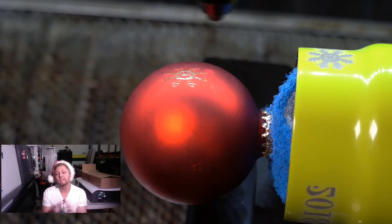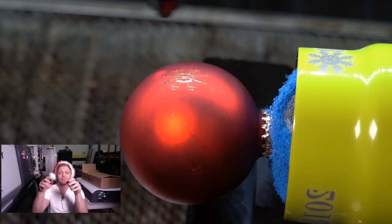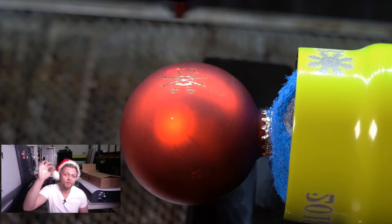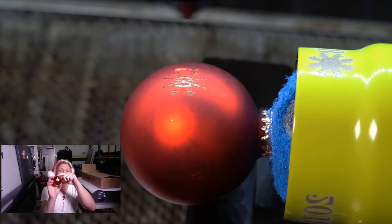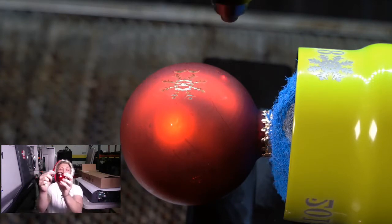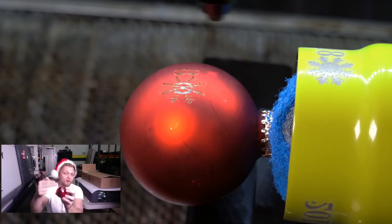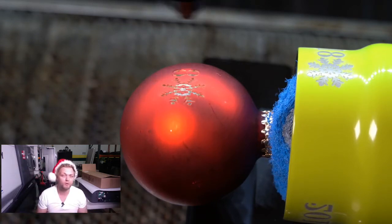When running an object like this, whether it's on the rotary or not, a rounded object needs to be focused to, but you don't want to focus to the top. What you're going to do is between your design — say your design is this big — you're going to focus between the lowest point and the highest point, right in between there, and that's where you're going to do your engraving.